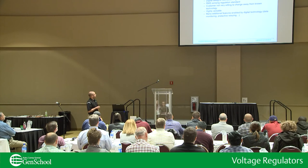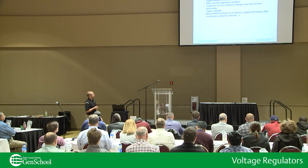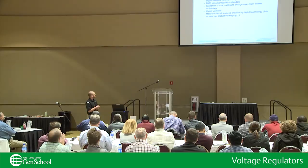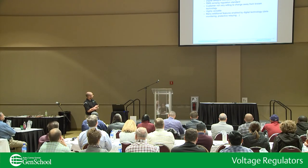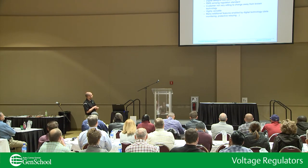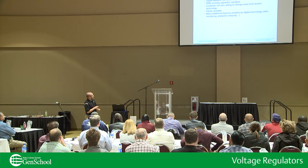Compared to digital voltage regulators: these are typically higher cost for basic functionality, though this is also changing as the industry shifts to a more digital age. In the electronics world, the higher the volume manufactured, the lower the cost per unit, so that is changing. They're becoming more widely known, and most digital regulators now have RMS sensing. We're also seeing digital regulators specified more often in customer specs.